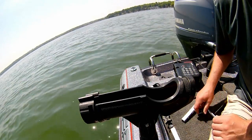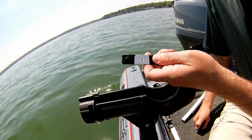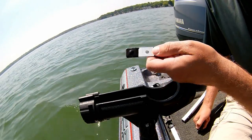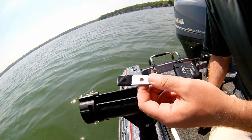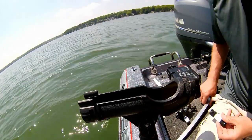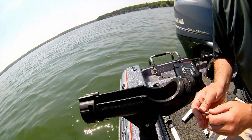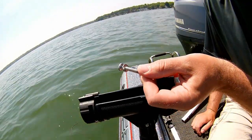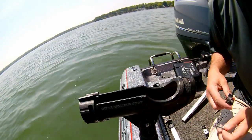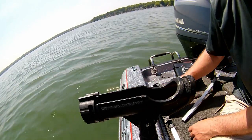To make the bracket, you just need flat half-inch wide aluminum stock, eighth-inch thick, three inches long, with a quarter-inch hole through the middle. A quarter-inch hole through your aluminum arm, an inch and a half long quarter-inch bolt, a lock washer, and then a tightening knob or a wing nut on top.